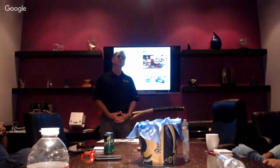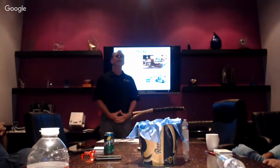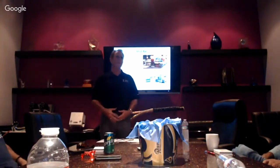Those are some of the things you really need to take care of. Are there any questions on the mod bar, how it sets up? Since it's going in before the flooring, so your floor finish is about half inch, three-quarter inch lower than what's supposed to be? It's generally just gone on whatever that finished floor height is, and then you just come to your thin set if it's tile, and then just cove up it. Is that answering your question?